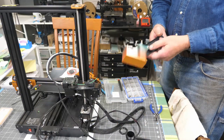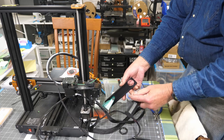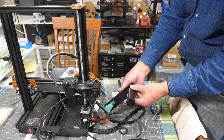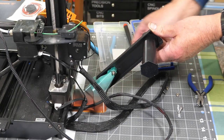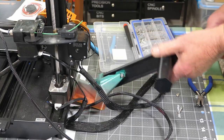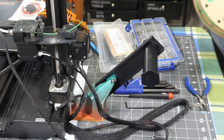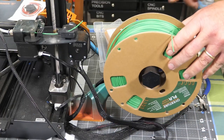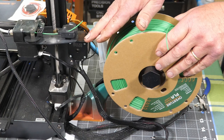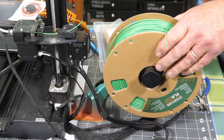Okay, so I kind of got this mounted on there — and yeah, I broke the top of it. A little CA glue will fix that. If I mount it over here I can get this lined up a little bit better, so I'll get a couple of T-nuts and get this bracket mounted on the side of the printer. That should give me some better alignment. Taking the spool and setting it on there — that's going to be much more direct, although when it gets toward the end of the spool it may ride on the bottom a little bit, but it's still going to be a lot better than running around with that sharp angle.